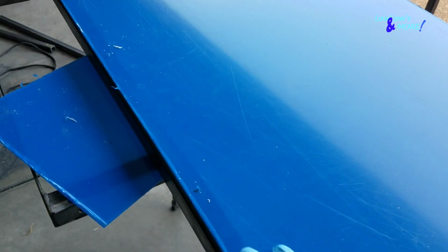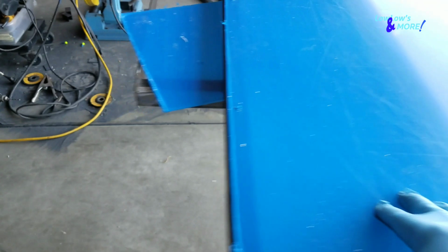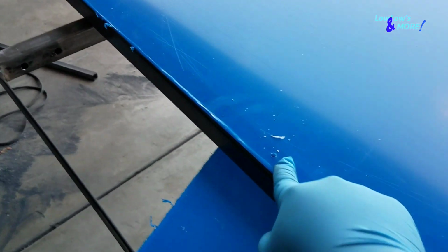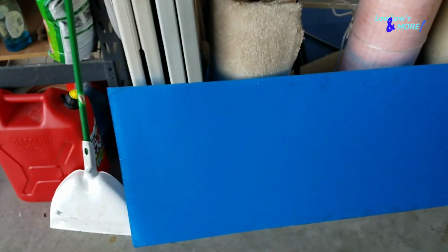I already drilled out the holes on the plexiglass. For drilling holes on the plexiglass, there is a special bit. You gotta take it real slow, or else you will crack them. The place where I got the plexiglass from gave me a practice piece, so I can drill more holes, or else they were gonna charge me $2 a hole. Can you believe that? $2 a hole. So I bought a drill bit that was only like $5. I drilled 1 practice hole, and I figured, just go slow and I won't crack anything. So I didn't crack anything on both.